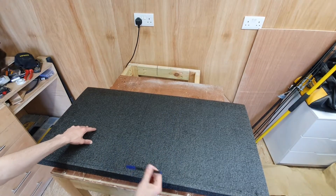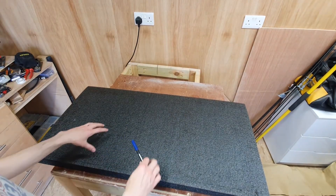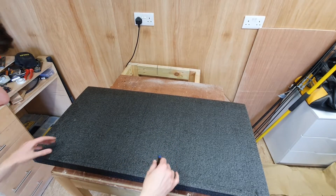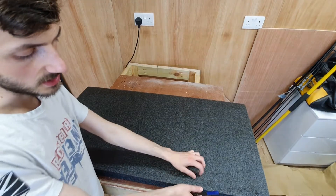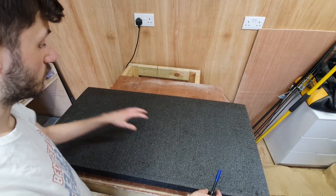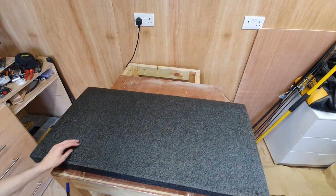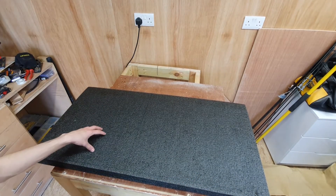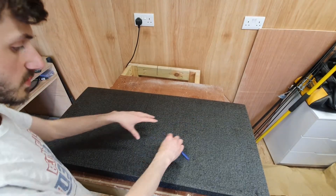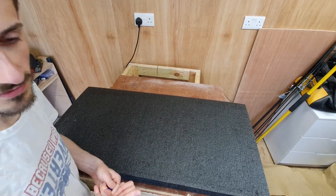I'm not sure how well you can see this but I've drawn some lines with a permanent marker. I've measured my drawer - this top section is what I want. Something I just wanted to note - I'm not sure if this is just my particular sheet or if I've left it over time - but it's not square the way they've cut it, it's slightly out. I measured a 500 by 1000 millimeters but this section here is actually 520 and my line slightly runs out. The ends aren't square, but because I'm cutting a smaller section out of this it really doesn't matter - it will fit in my drawer just fine. Just something to be aware of.